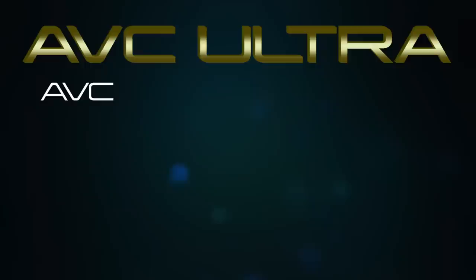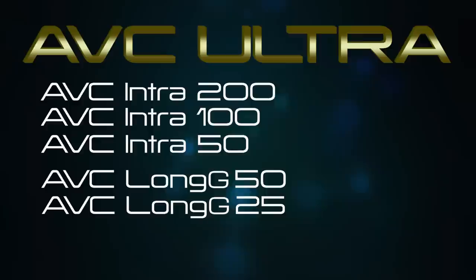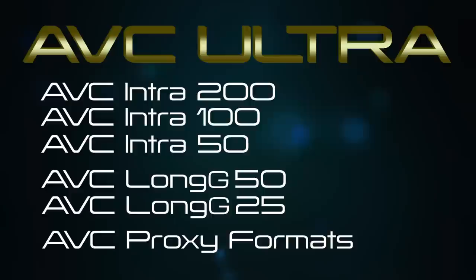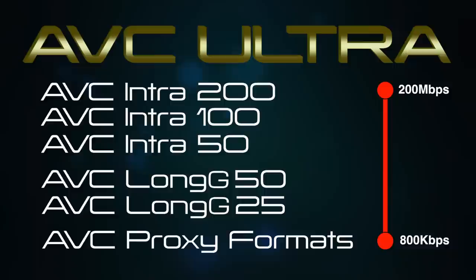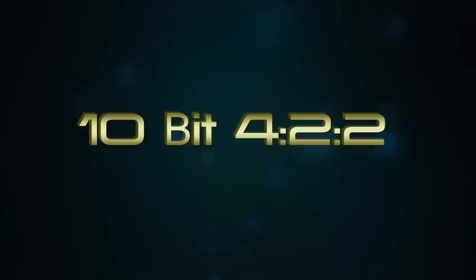The 270 includes a wide variety of recording formats available in the AVC Ultra family. On the high end you have the absolutely incredible AVC Intra 200, as well as AVC Intra 100 and 50. For shooting long-form presentations such as seminars, the AVC Long GOP 50 and 25 formats will give you the perfect balance between bandwidth-friendly and super high quality. You also have several AVC proxy formats for low-bandwidth direct-to-web shots or as quick reference footage that you can record simultaneously with the higher quality formats. Recording formats range in bandwidth from 200 megabits per second down to 800 kilobits per second. You also have several legacy formats like DVC Pro HD, DVC Pro 50, DVC Pro, and even DV mode. Many of the recording formats support in-camera 10-bit 4:2:2, which provides exceptional broadcast image quality and is excellent for green screen or heavy secondary color correction and effects.